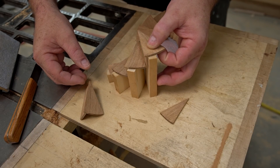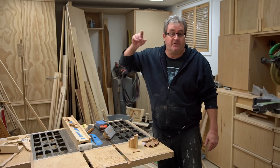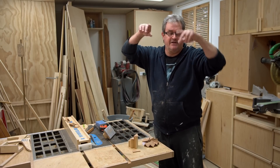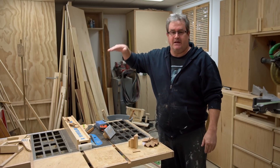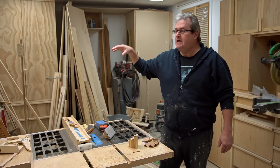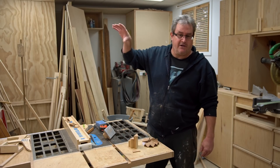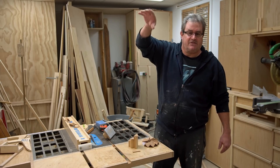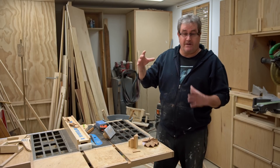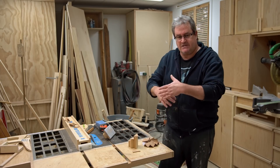This all has to go smoothly because there's a common difference between these. If you've ever framed a roof, you've got the gable on the end and the jack studs in there — they have a common difference. You start off with one, say 12 inches, and then with the pitch of your roof you calculate how much taller the next one needs to be, and then the next one after that. You don't have to measure each one; you just look it up on your framing square.